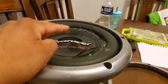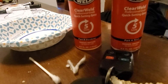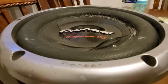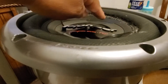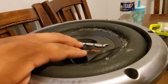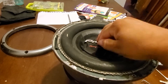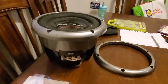I removed as much of the silicone as I could, which took some foam with it. I used an adhesive I trust and have used many times — put a nice bead of it underneath and let it dry. I tested it in my truck and it still made a very faint noise, so I went back over it and doused it in epoxy. Now the sealed suspension is very tight. Before it was very loose — you can see this one is loose if you push on it, but the repaired one is much tighter and is back to being a sealed system.